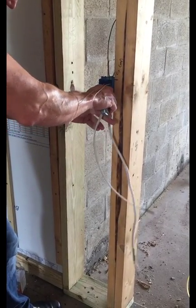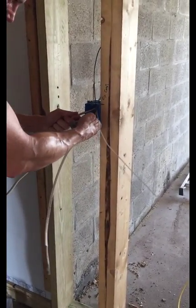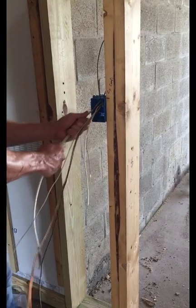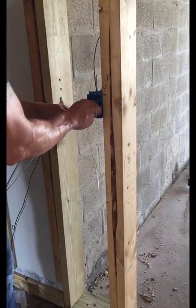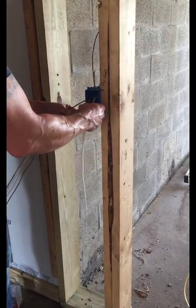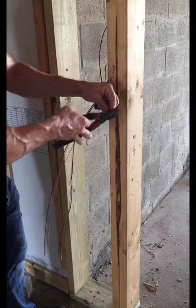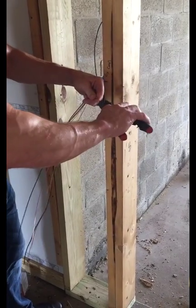Remove the sheath from the two power wires. Whenever you're wiring a switch or anything that has power going in and power going out to feed something else, it's similar to those outlets — except there's no outlet connecting the wires. Since you don't have an outlet making that junction, you just make the connection yourself by twisting them together. Normally an outlet would connect all the neutrals, but since there's no outlet here, you just wire all the neutrals together yourself. That's why if you look in one of these boxes, you generally just see all the white wires tied together.